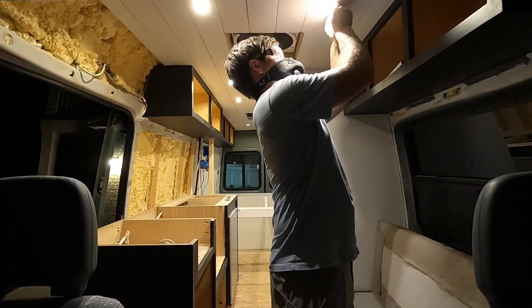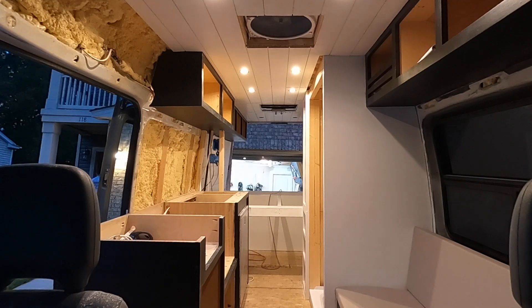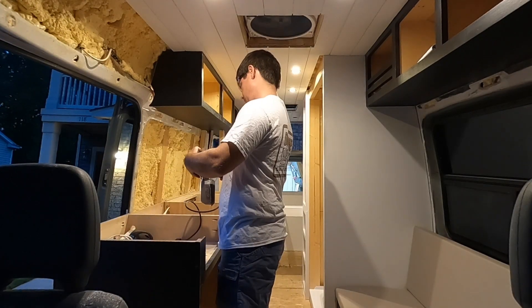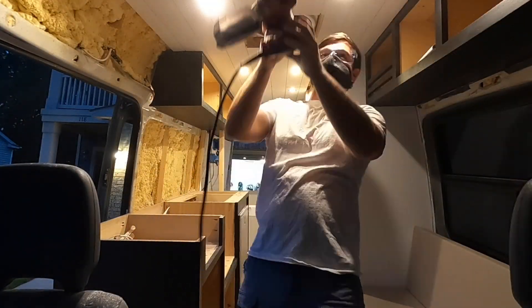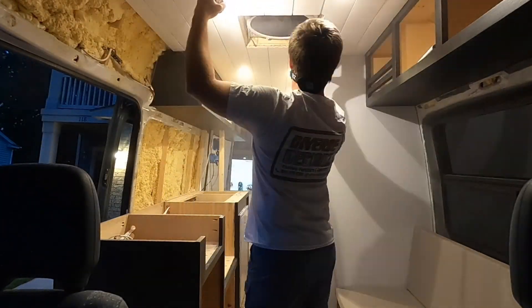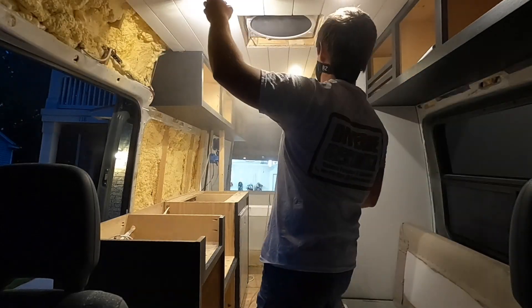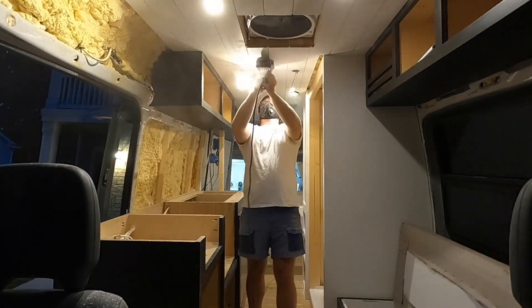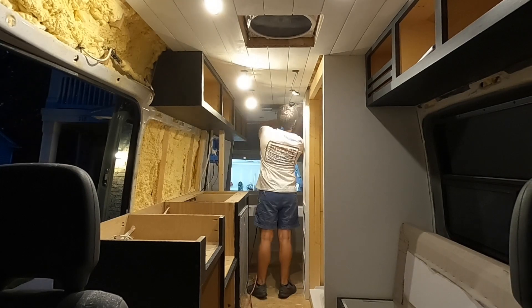Another thing you can do if your lights aren't completely installed and you're working at night: pull them out of the ceiling and shine them where you need to — it casts better light on the surface and reveals surface imperfections. This is a trick I picked up from a contractor friend who showed me how to find imperfections in drywall: take a flashlight and shine it down a wall, and the shadows will show all the imperfections. Unless you live in a really expensive custom-built home, you'll probably be amazed at the imperfections in your drywall.